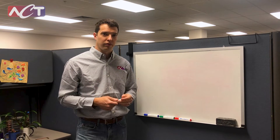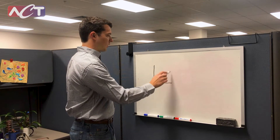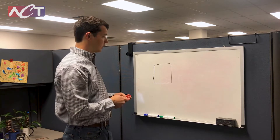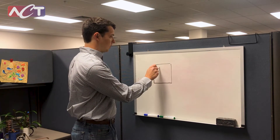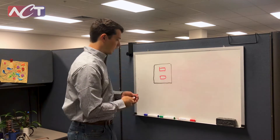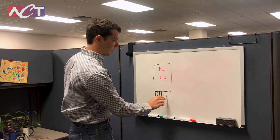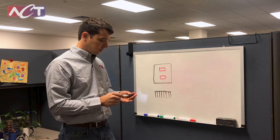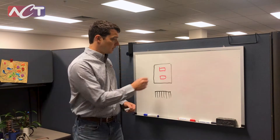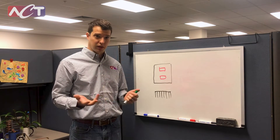This can be used in a number of different ways. The first way is for a heat sink. Let's imagine we have a heat sink here — this would be the back side of the heat sink. We have two heat loads here and here. Without heat pipes in this heat sink, the heat is basically just going to spread out across that base plate through the conduction of the base plate material, typically aluminum.